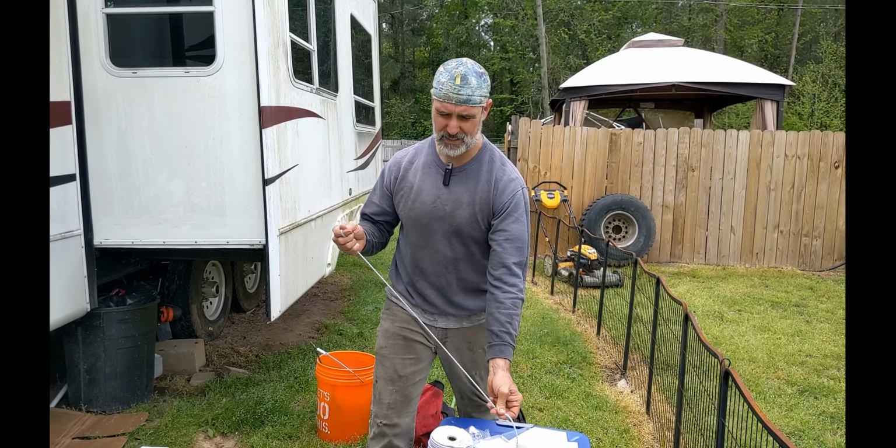It's important to take a lot of care when you're drilling a hole as deep as this. If you're not very close to perpendicular, it's going to wander. You'll end up penetrating in the middle here and somewhere substantially off center over here. So we actually did a really good job of coming out in the middle.